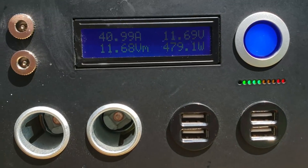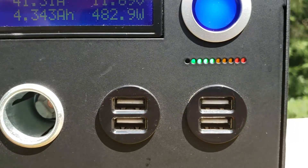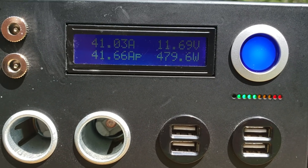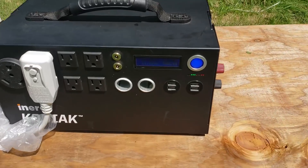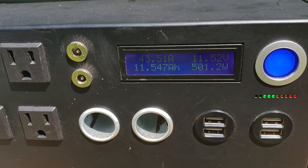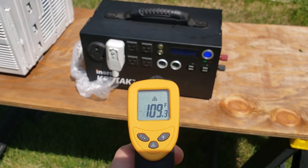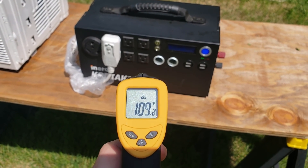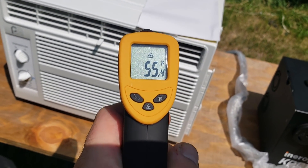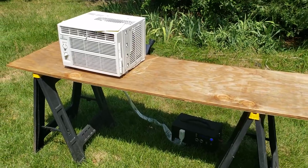The Kodiak generator is running at 479 watts and we're showing 90% power. We started this test at 12:25. Now that we're all wound up, we're pulling exactly 500 watts. The Kodiak itself is reading about 109 degrees as we move over to the AC blowing ice cold.